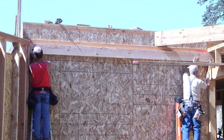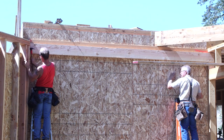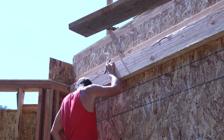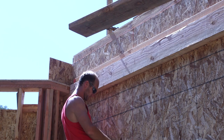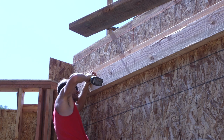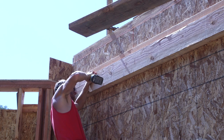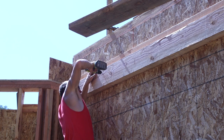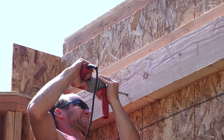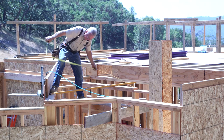These GRK screws are very large and very aggressive, so to be safe, we drilled pilot holes first. Usually a pilot hole in wood is about the same size, perhaps a little smaller than the root diameter of the screw. The root diameter is the diameter at the inside of the threads. A pilot hole keeps the wood from splitting when you drive that wedge, that is a big screw like this, into a stud, and it is never a bad idea.